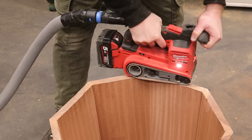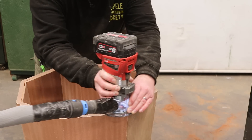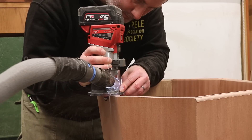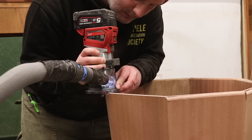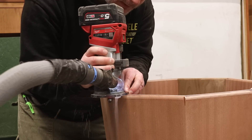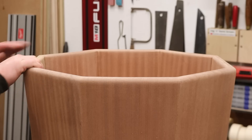This left a rough surface so out came the belt sander. I decided to cut a round over to the top edges, although the first one I cut looked a bit small so I swapped it over for a bigger bit. I got a bit of burning here, maybe my router speed was set too high. When I routed the outside edges I had to be careful not to tear out the grain where one board met the next, so I just took multiple light passes to get a nice clean cut. After sanding it all turned out pretty nice.